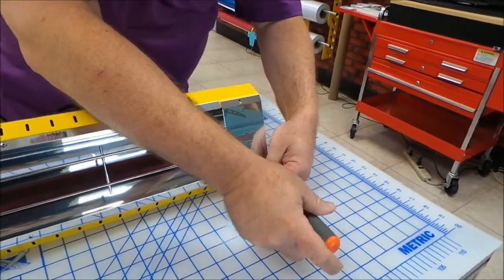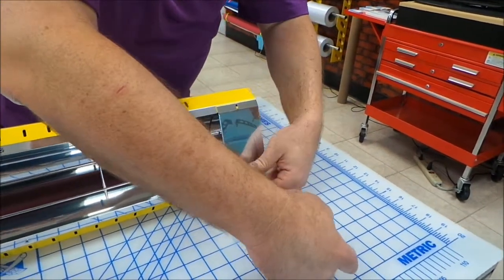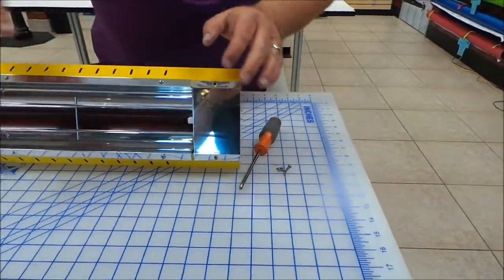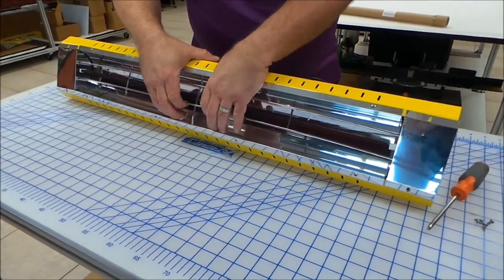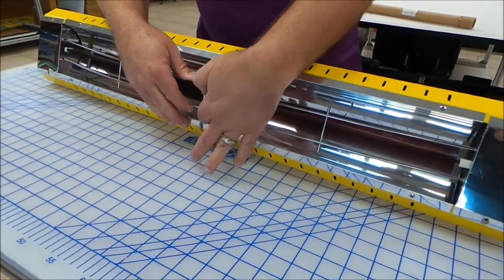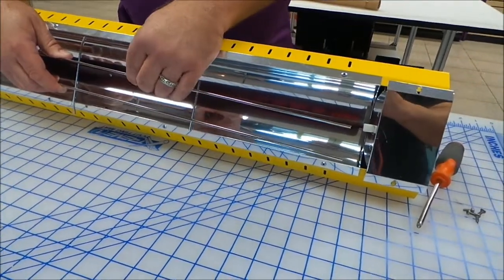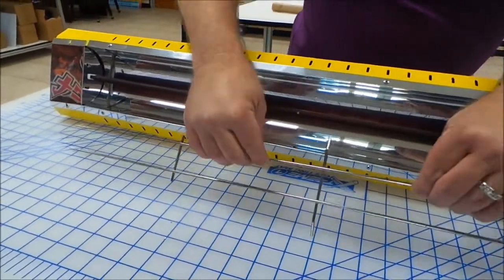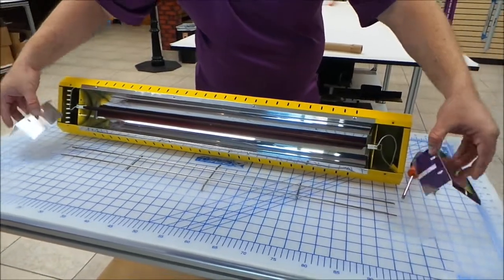Four simple Phillips head screws come off very easily. And then before the shrouds can actually come out, you'll notice we have to take off this grid. This protective grid is for your safety, and it's very simple. You lift up first, push down second, so they pop out of these two holes, and then you can slide this way, and then over here, we just simply slide it out of the slots, set it down, and the two protective shrouds can come out very simply.